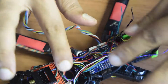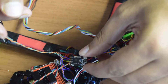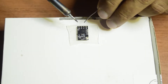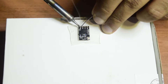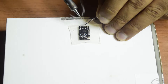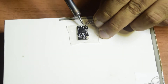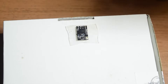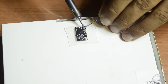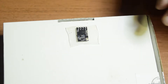I've given the wires a twist so they stay together. Now let's install the Express ELRS receiver module. Let's tin the pads on this radio receiver — ground first, then voltage which is going to be 5V from the 4V5 pin on the flight controller, then TX, and then RX. The pads on the radio receiver module are now properly tinned.